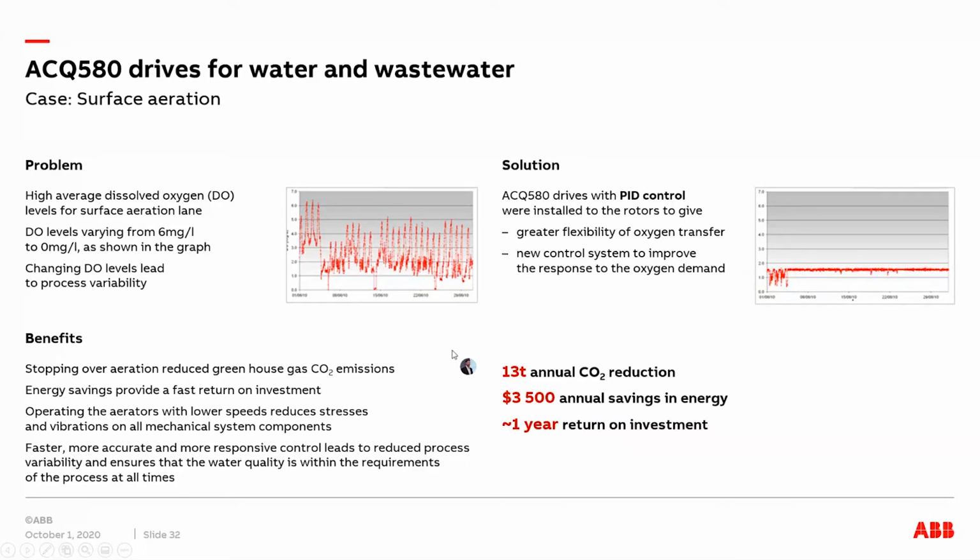These actually became, maybe you can hear it in my voice, they became my favorite application doing aeration, and not just in mechanical aeration, rotary or surface, but in blower aeration. And I love the closed loop capabilities, and more recently now, even linking that back to the ammonia, so that we can have different reactions from the drives. But again, a lot of it takes an understanding of the process and getting involved, and you know, this is where the knowledge of our partners, and certainly the ABB staff on the applications is core to achieving the right goals for buying a drive.